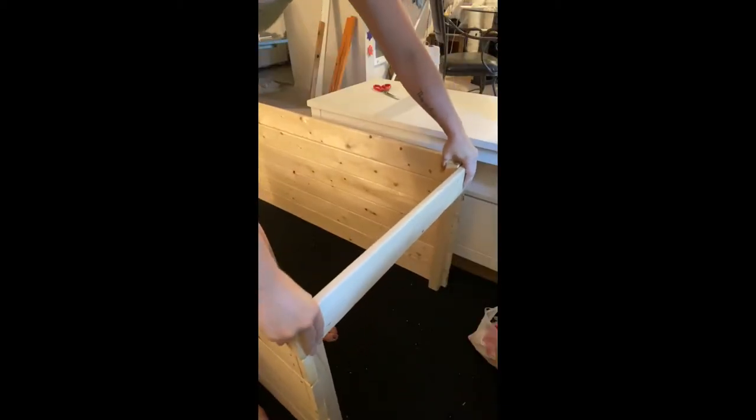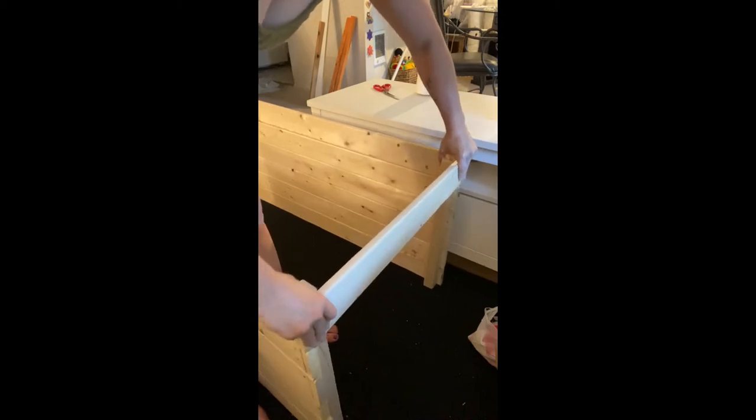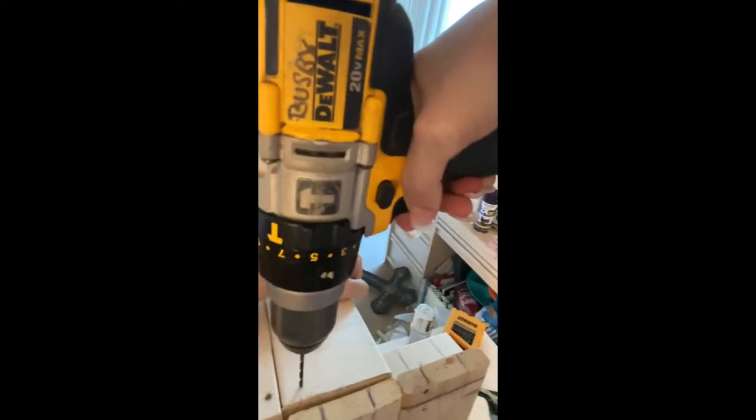The sides of the chest are created by 6 2-foot-long 1x4 boards that will be attached to the same 1x1 boards used to create the front and back. Make sure to draw lines where you have drilled holes for the front and the back so you can taper the screws needed for attaching the sideboards. You will also want to pre-drill holes before attaching the boards with screws.